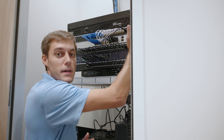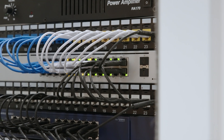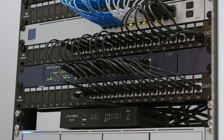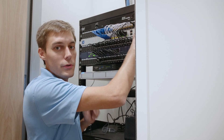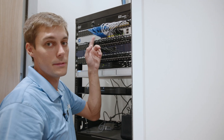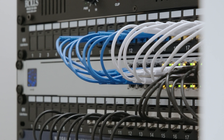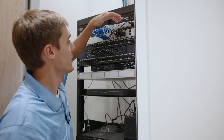Next we have our first patch panel. We always put our cameras and phones — basically our PoE devices — on the top. It makes it super clean, and I like having the PoE switch up top. We've got our other two data patch panels, and as you can see we only have a 24-port switch down here and a 24-port Ubiquiti switch up top. The Ubiquiti switch is a USW24 PoE, which is deceiving because it only comes with 16 PoE+ ports. As you can see, I've got my blue keystones and blue patch cables going into the first eight slots and my white ones going into the second eight slots.